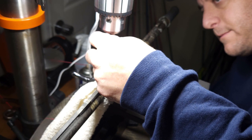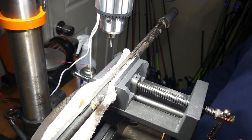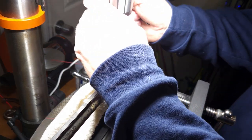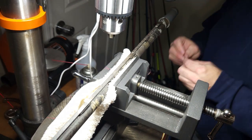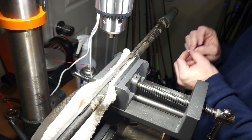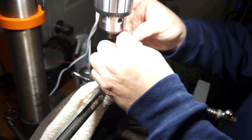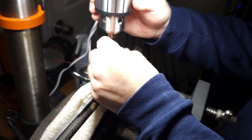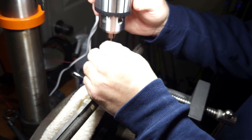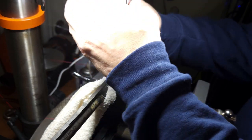That's the plug tap. It's not got enough depth that it's cutting the threads like it needs to, so I'm going to have to go in here and drill this some more. Looking at the end of this, about half of that is where the threads haven't even started. So make sure I get that bit. I'll slowly open this up until it just goes up in there. Get a good bit of the way. Tighten this down.